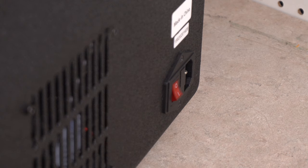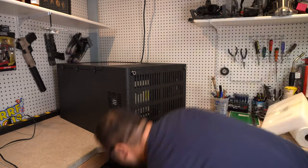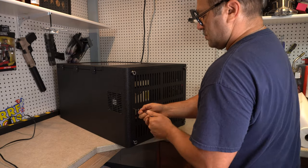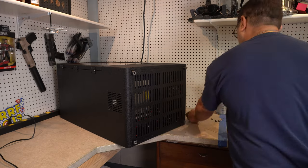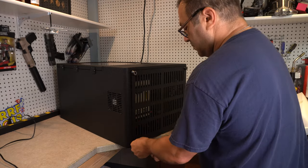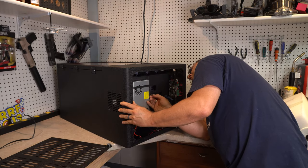On the right-hand side we've got a USB and an ethernet port, so in the future we'll be able to run an ethernet cable. We also have power and the plug. The first thing you want to do before you plug your printer in and turn it on is to check and make sure the voltage is set correctly for your region, which can be done by taking the screws out and switching it to whatever voltage you live in.